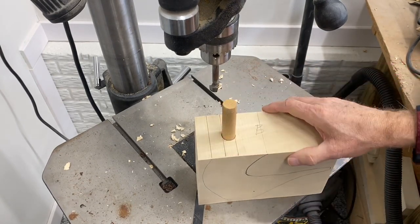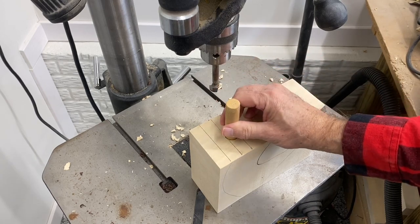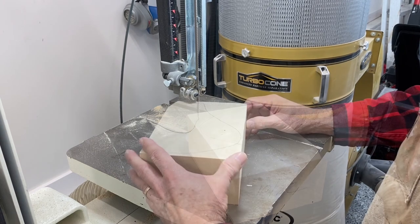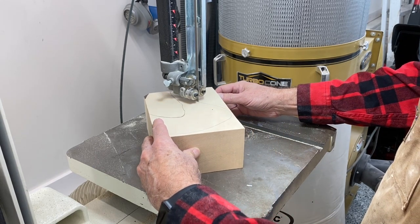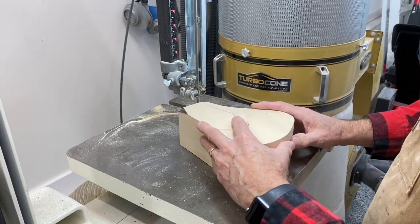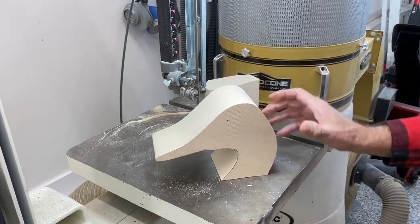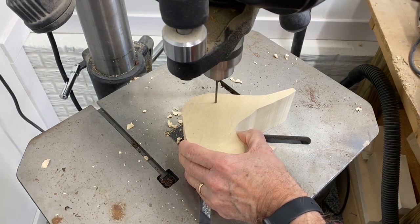That gives me a nicely and squarely positioned hole, so as I'm attaching it to the body I know this dowel is perpendicular to this surface. Now I'm going to go ahead and cut out the head on the band saw. I normally start right at the end of the bill so I can carefully define where that is and make sure I don't cut off too much material. The film is sped up here at about twice normal speed — finishing the definition of the end of the bill, carefully making a cut from that direction and from the neck up to meet that cut to finish.